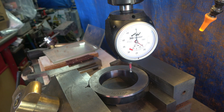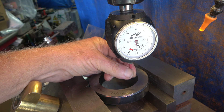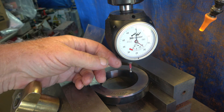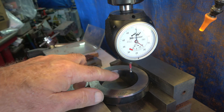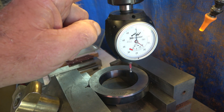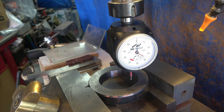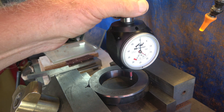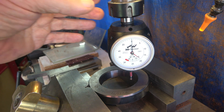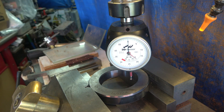So this is the Hymer and it's what I call a 3D sensor. It moves in X, Y, and Z as well. The principle is that the ball is 0.200 inches in diameter, so when the ball makes contact with the edge, you wind this round two complete turns and that will put the centre line of the spindle over the centre line of the hole. Now this is done statically — don't turn the machine on, it's a static thing.